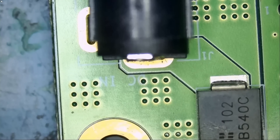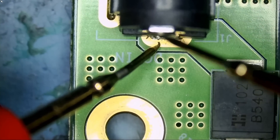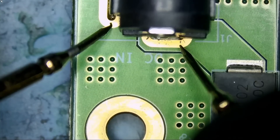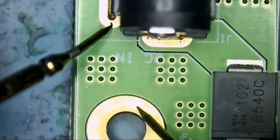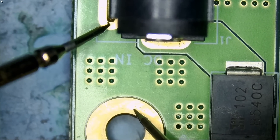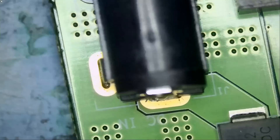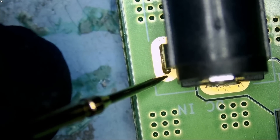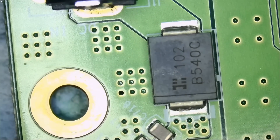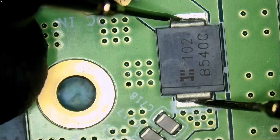Meter in diode mode. That's where the charger plugs in. I want to quickly test that we have a connection from the pin of the charger onto the board. Do we have a short circuit? This should be ground — I'm reading nothing unless this is not ground. If we do this we got a beep, but if we do this we do not get a beep, so this is not the same as this. What if we put the probe here? That's ground. We have a diode here. Measuring in diode mode: 0.18 voltage drop, flip the probes — OL. Diode is good.